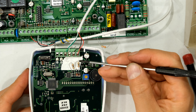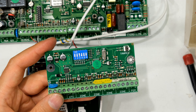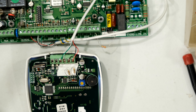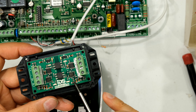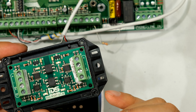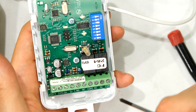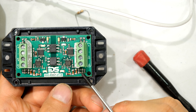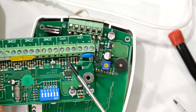I put some tape here just in case somebody's rough and depresses the resistor — I don't want the wire to short out anything. For this expander board it has the exact same problem, so I'll do the same repair. Something to keep in mind: sometimes it's one diode dead, sometimes two, sometimes all three. Sometimes I've done the repair and it still doesn't work — I've noticed that when the resistance between the second and third pin of the IC is in the kilo-ohm range, I can't salvage the board.